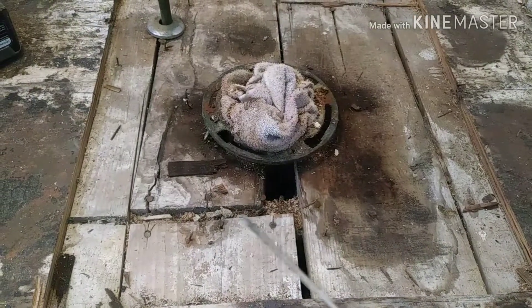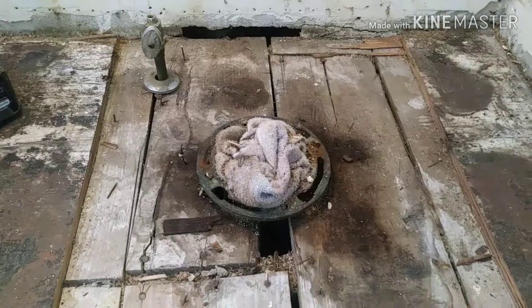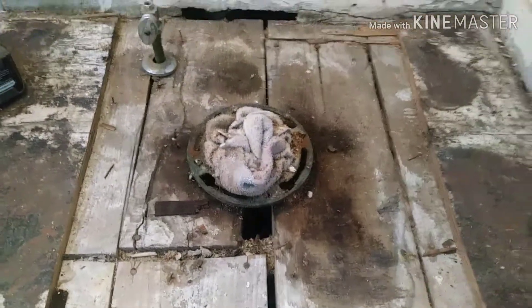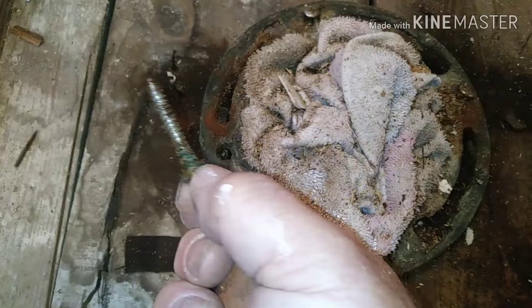There was a laminate floor on top of a thin tile floor, on top of five-eighths plywood, on top of that three-quarter slat board. The flange is in good shape, we can leave that. Every house is a little different as far as subfloors go. That's why I said just take your time and remove one layer at a time while you're digging into this thing.